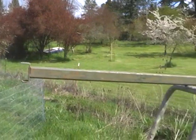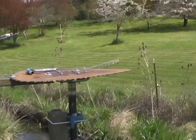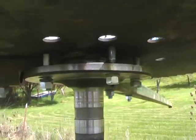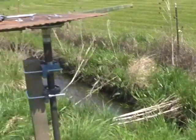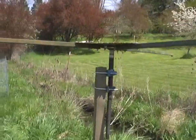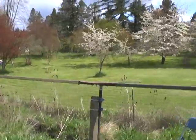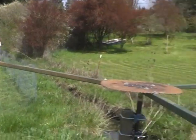I have two arms — I have one supported so it doesn't spin, but already the weight is being supported fairly well all by itself. So the last and final one I'm able to put on with just two stepladders by myself. The trick is to have the end piece wedge into the hub — that way it's held up while it's on the stepladder too. With all the bolts tightened up on the hub, arms, shaft, and bearings, I'm going to start removing stepladders. The structure seems pretty stable — it's supporting its own weight. The arms are pretty flat and equal with one another, and when I straighten out my post with some guide wires, hopefully it'll be very sturdy and I'll put some wings on it.